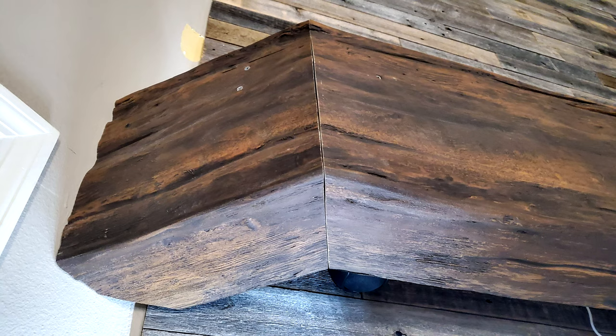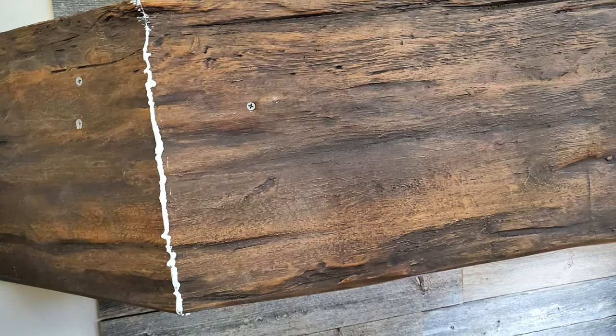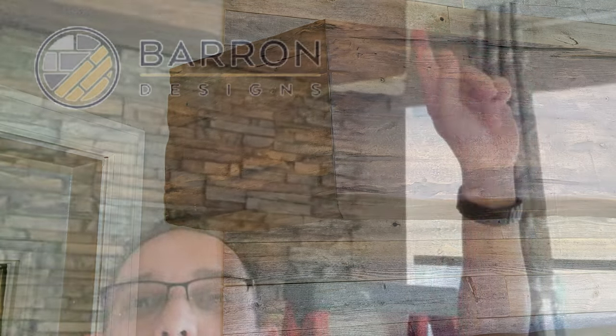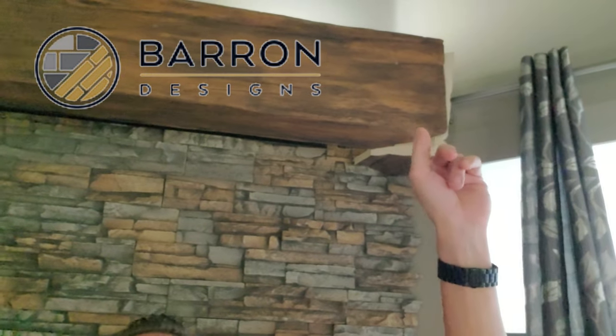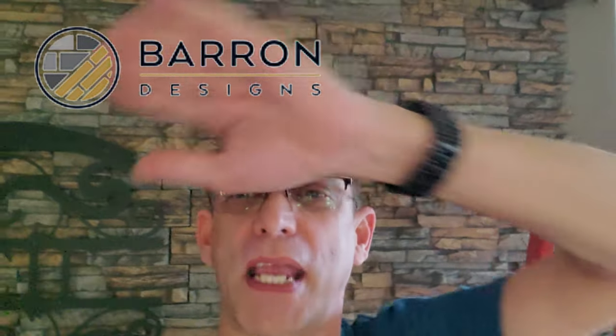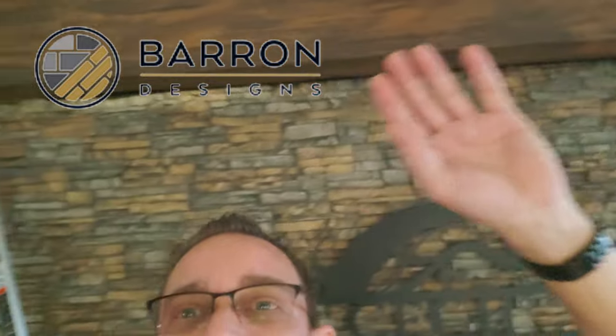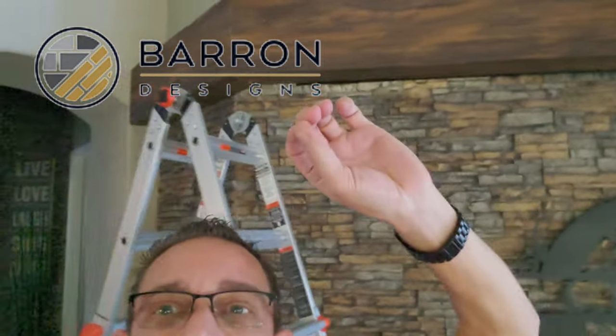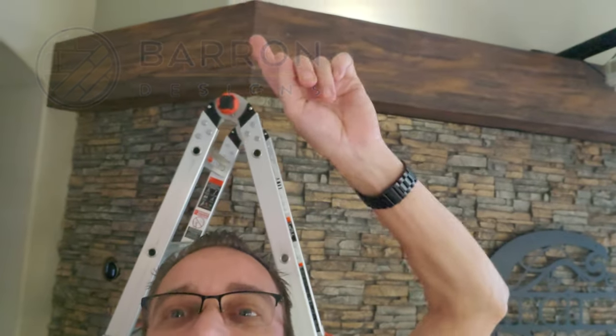So the angles are the most difficult part doing the faux beams, as it was doing it on the stone panels. But I think the faux beams are even a little bit more difficult because you have that grain to match. Anytime you make a 45 cut like this, or a cut where you want to meet at an angle, you want to use the same leftover piece so that the wood finish matches around the corner edges, as you can see here. See how that wood kind of blends right in as it goes around that angle there. Same with right here on this angle. It flows really good.